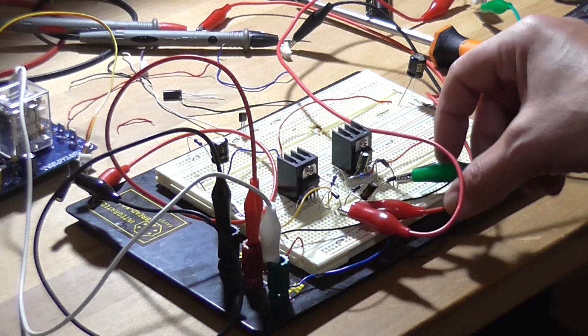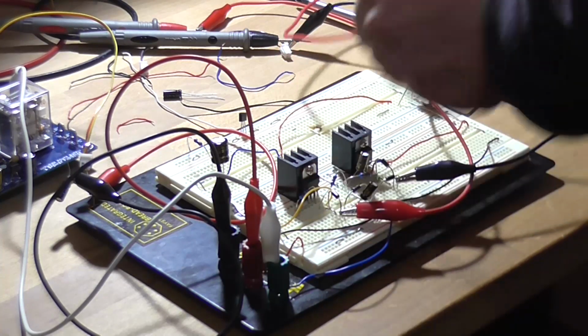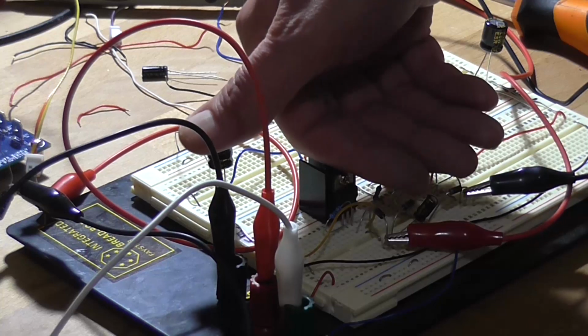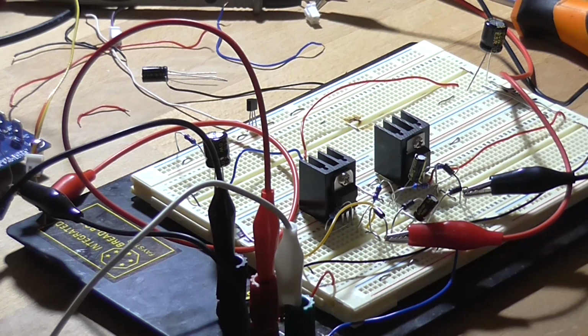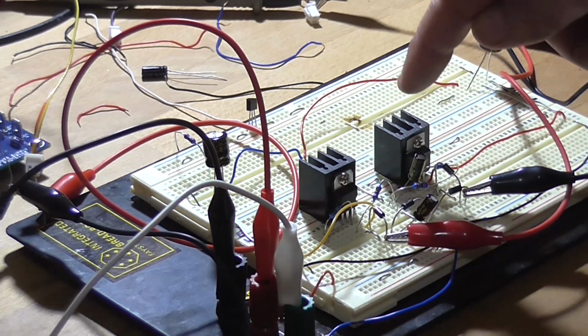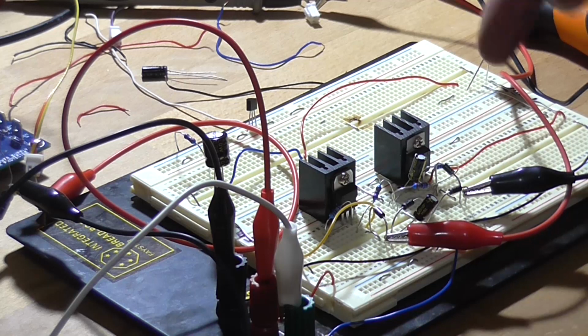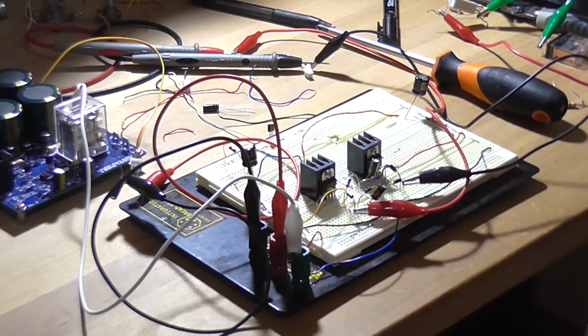It works. I knew it would. I've built this circuit before. I just never went through it in depth before. So yeah, no, that works. I have actually modified that PCB that I showed you before to actually accept these regulators. Although I had it routed with pin 3 and pin 2 the other way round as I had it set up initially, and it didn't work. So I've now corrected that on the PCB, so it's the correct way around, and this resistor is useless.